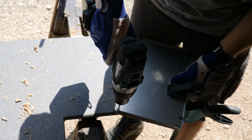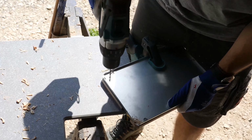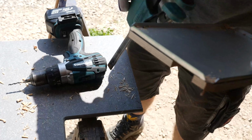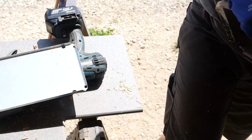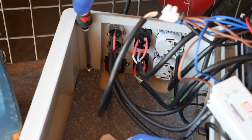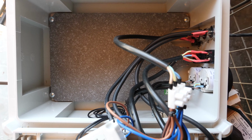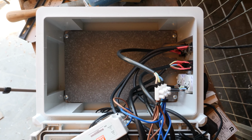Aside from the 2 cutouts to avoid collisions, I only drilled 4 more holes in my new baseplate. These holes are a replica of the holes the original metal one has. The holes are necessary for the screws that bolt the base plate into the housing. I was lucky that the original screws were long enough to still work with my much thicker wooden base plate. Check that in advance if you decide to go the wooden way.